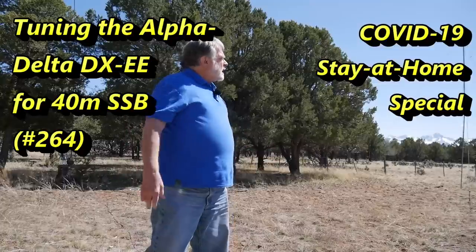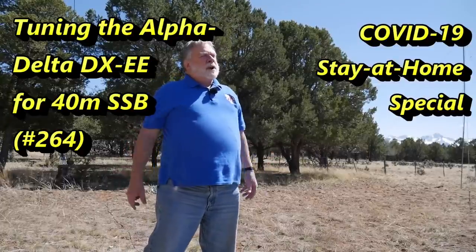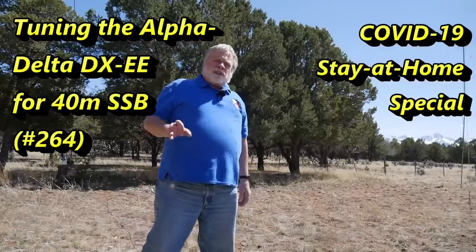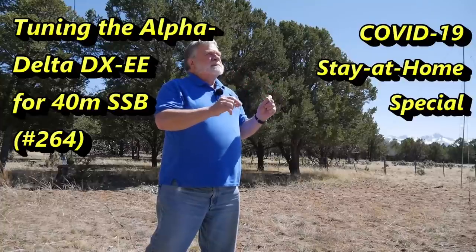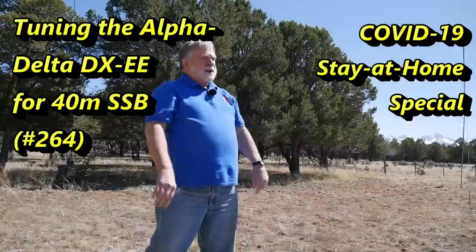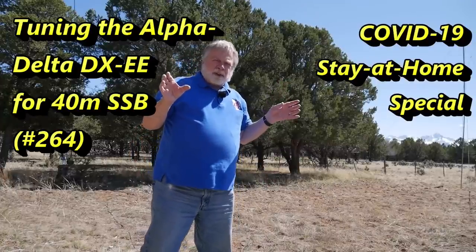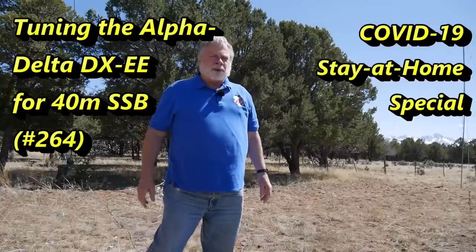Today we're out on a beautiful, beautiful spring day. Don't know what tomorrow brings. Somebody is saying snow, but it's sure gorgeous today. Thought what I'd do today is take the Alpha Delta DXEE antenna, put it back up, which I have right over there, and see if we can adjust the 40 meter end of it to bring it in so it can cover the general band on 40 meters. Well, I was successful, and I'll show you how I did that.